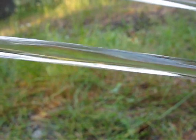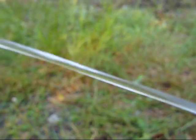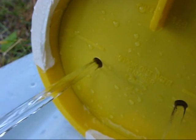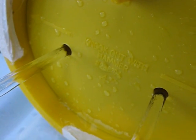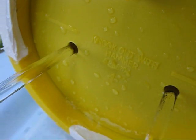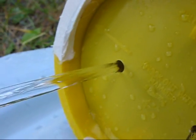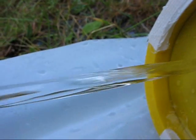One: the flow is spraying and dripping. This is a great laminar jet, but compare it to this one spraying all over the place. The difference is that the spraying jet has a tiny piece of plastic sticking out from its outlet — so small you can't see it unless you turn the water off and examine the drilled hole. By making sure the edge of the hole is perfectly smooth, the jet will also be smooth. If you use thick PVC end caps instead of test plugs, you may have problems making the perfect outlet, because the water is traveling through a wide edge rather than a hole in thin plastic.